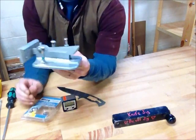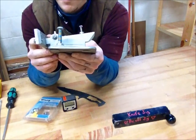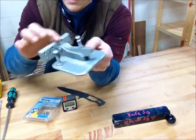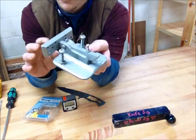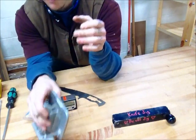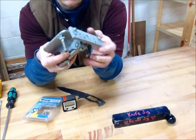So I took this — it's just a flat plate of steel on the bottom, maybe 1 and 1/8 inch thick. The center piece is aluminum and this piece is aluminum. I did that because I wanted it to be a heat sink to transfer the heat from grinding. I think it does really help. It's all painted so I can just dunk it right into the water and don't have to worry about it rusting.